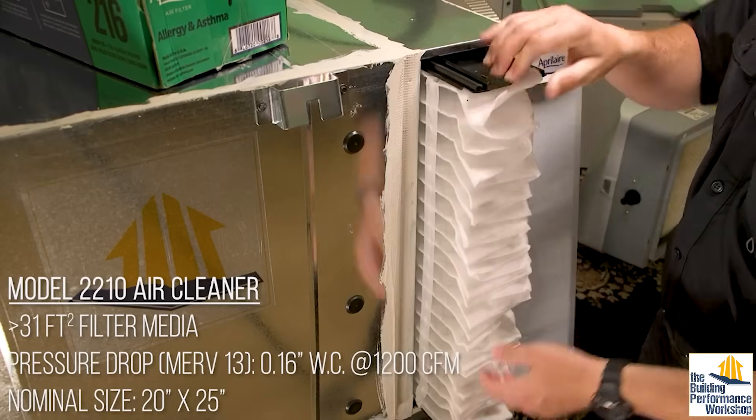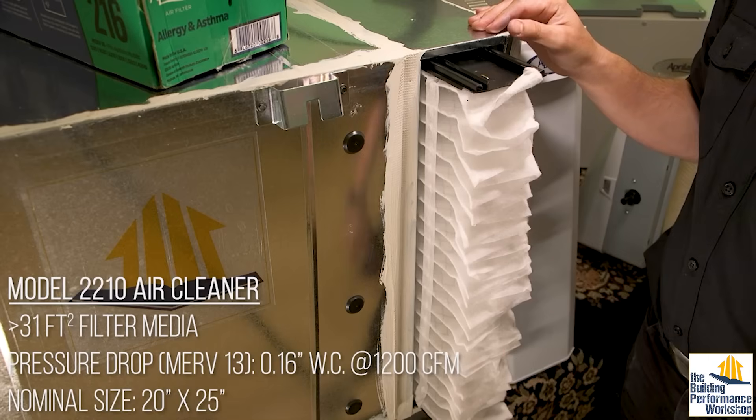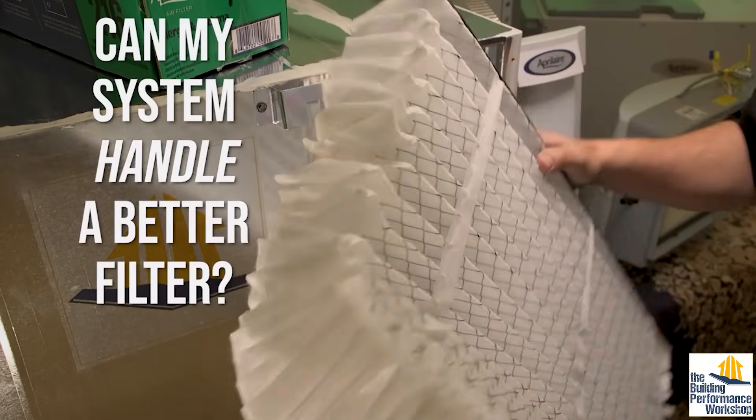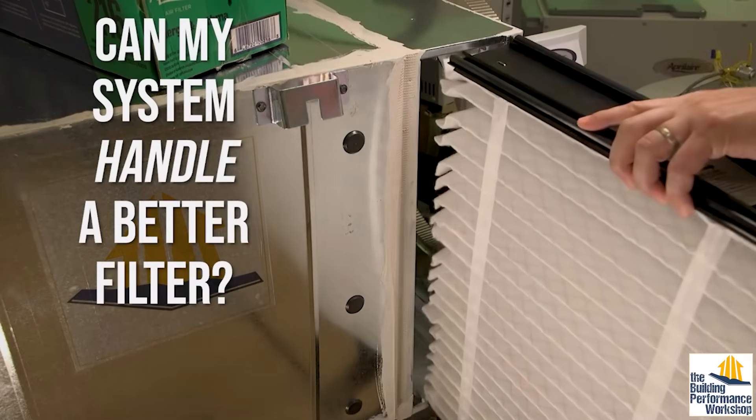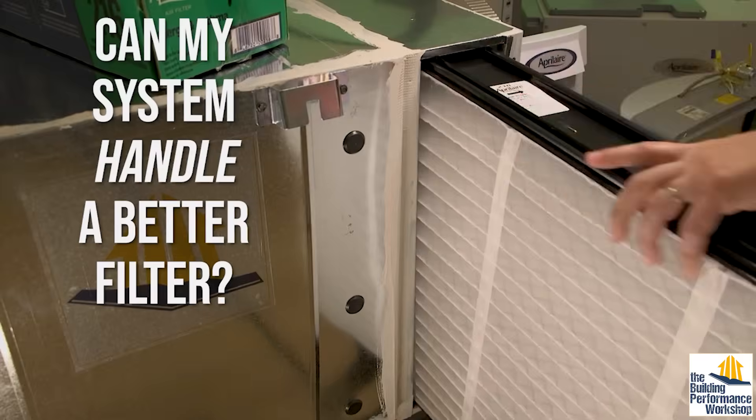People who know what I'm talking about have a three-inch, four-inch, or five-inch thick filter, and the more you increase the filter media thickness, the bigger and bigger the filter's surface area becomes. For example, a four-inch media filter is going to have nine times as much surface area as a one-inch filter. And I have been to the big box stores — you can't find a filter that's more than one inch thick at these places.